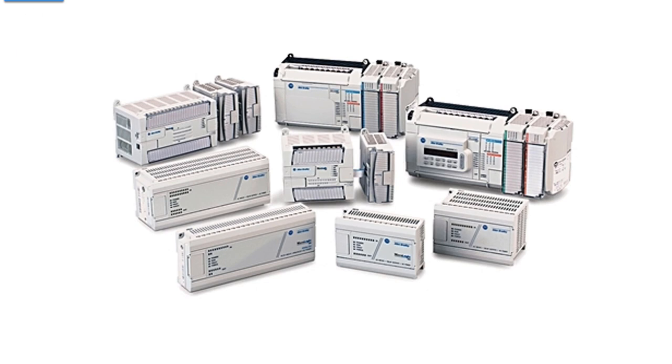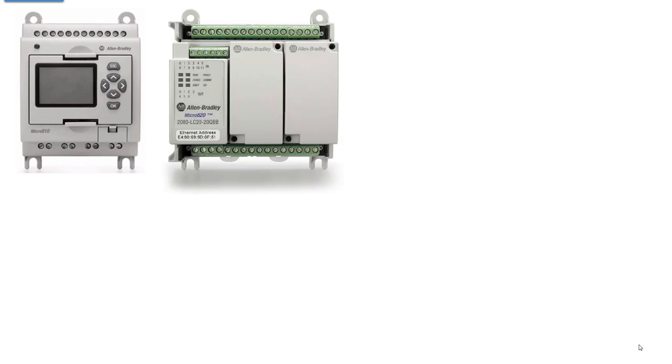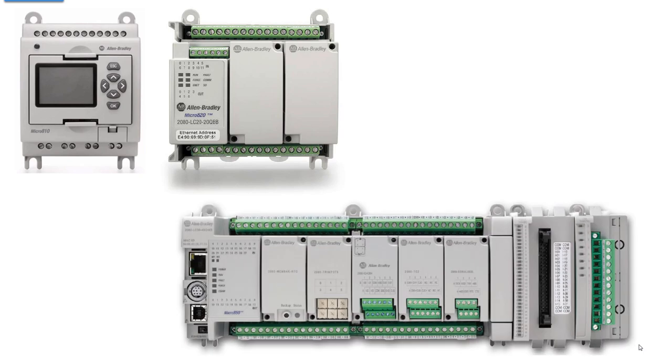This is a more current family of micro controllers. The Micro 810 uses a special USB adapter that costs about $40. The Micro 820 has an Ethernet port and six terminals at the top for a hardwired RS-232, plus two covers where you can add snap-in modules. The 850 has Ethernet IP at the top, an RS-232 round DIN connector, a USB port, and right below that a mode switch.